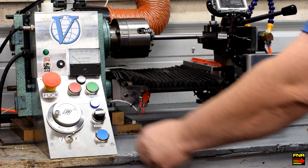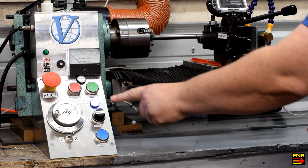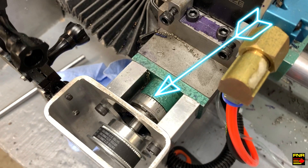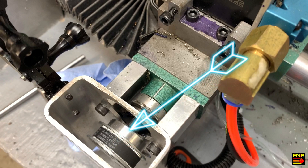Hey there YouTube, Barnarth Racing here. Notwithstanding all the great work we did to build version 2 of our CNC lathe conversion project, there's still one aspect of it that I'm not fully satisfied with, and that's this part right here. The way I mounted the stepper motor to the cross slide, or the X-axis, was to just fabricate a quick and dirty mount that attached the stepper motor via a pulley to the normal manual cross slide, and that means I used the original lead screw and the original way of mounting the lead screw to the cross slide.